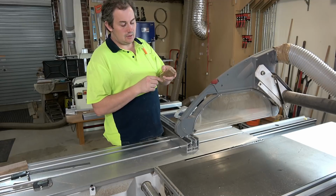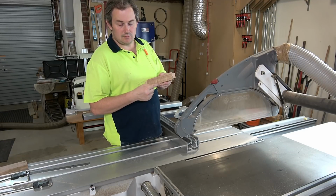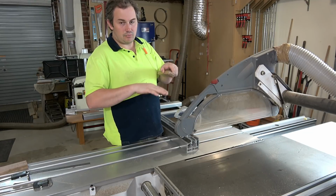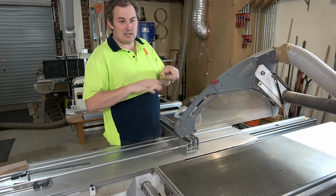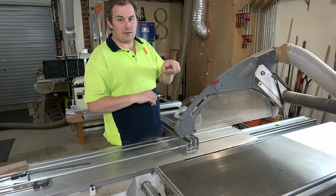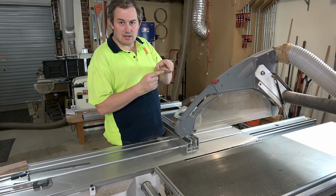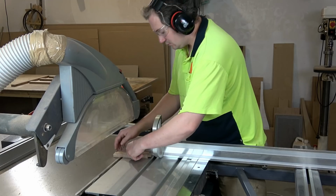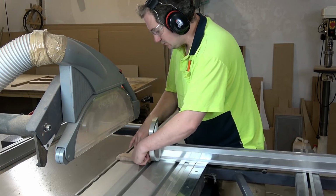What happens is when you're cutting a groove into the middle of the timber, the timber fibres are supported from both ends. They're actually bridging the gap. So in order to break out, you kind of have to wrench it right out of there. But when they're just on the end there, all they need to do is fold straight down. Very easy for that to happen. So you always cut your shoulder lines first, then clear away the waste.